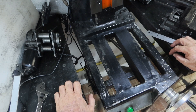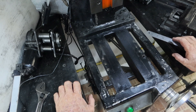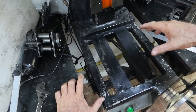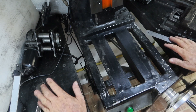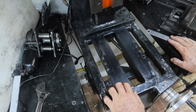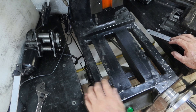I was watching a video the other week — an Aussie guy built a CNC and when he mounted his post he lathered it with some sort of epoxy, bolted it down, got it all level with jacking screws, and just let the epoxy set so he had a completely flat surface. I don't know if I want to do that here — I might just have to shim it where I've got to bolt it so it doesn't distort when I bolt it down. Anyway, that's a cleaned-up surface — let's try to fit it on and see how it goes.